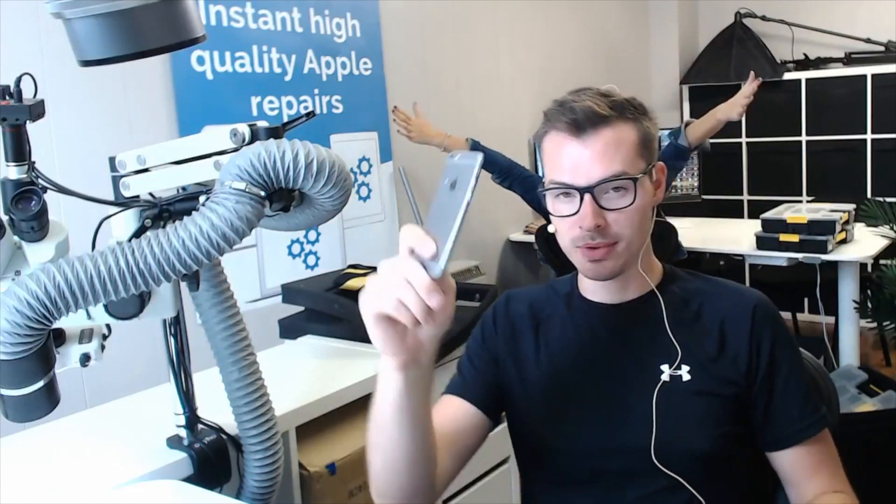Okay, we're live. So we've got an iPhone 6 here. I'm going to show you how to diagnose and repair the tri-star issues. The symptoms are: it's got issues with charging, it's boot looping. They also replaced the battery because of the charging issues and boot looping, but that didn't fix it. It's still boot looping even off a power supply or new battery, and iTunes doesn't recognize it — even with a new charging port. That's the most common symptom: if it's not being recognized by iTunes, it's tri-star, usually.